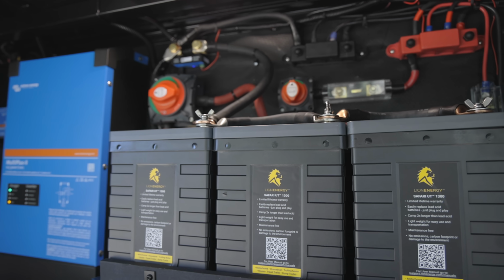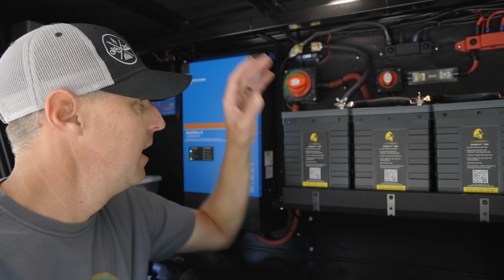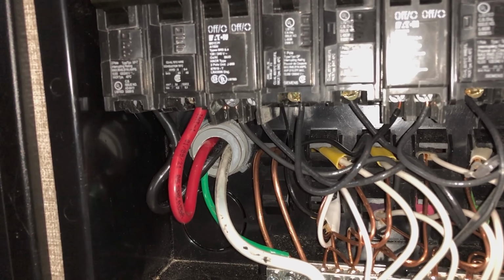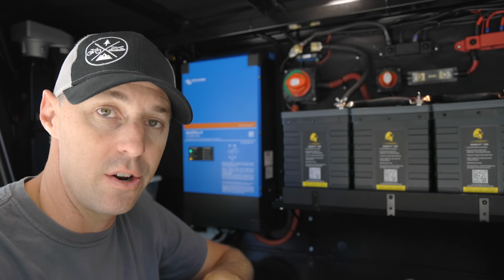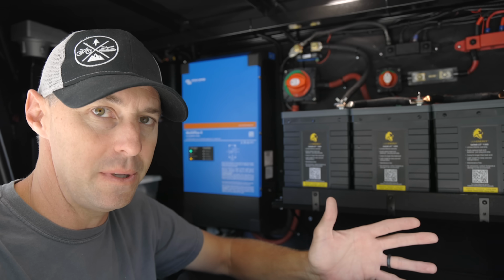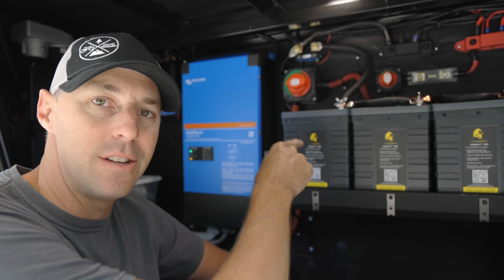So here's our setup. We have everything really compact and very close together, so we don't have any losses in the line. But of course, the unit here, it is connected in with conduits. We have flex that comes from the EMS surge protector, but we actually have PVC going back to the RV breaker panel. Because this has the capability of having 50 amp input if you're connected to a 50 amp generator that's only 120 volts, and then this can still actually boost from there. So if you're spreading that across the two lines, the breaker won't trip inside. So that neutral might actually be carrying more than 50 amps back to the RV breaker panel.